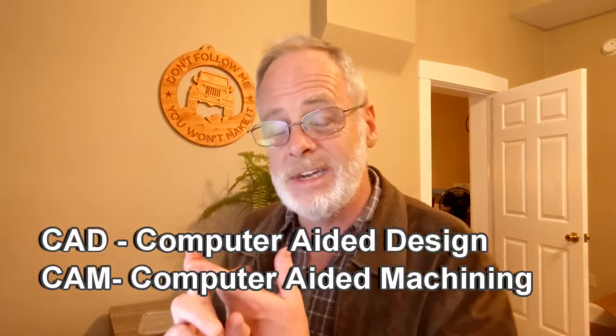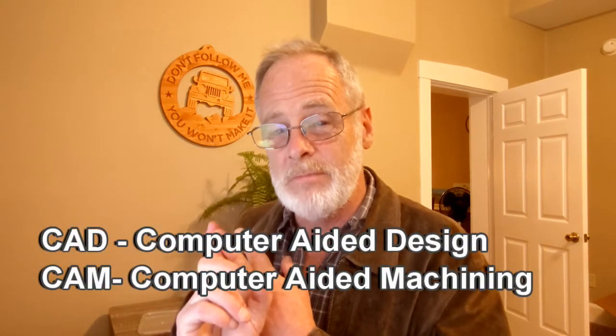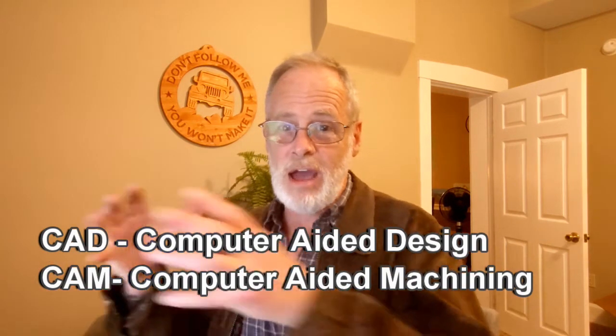So what I'm going to do is I'm going to go into VCarve, my CAD/CAM program. For you as a beginner, CAD is computer-aided design, CAM is computer-aided machining. So we're talking about CNC routers and the software that generates the drawings and the G-code. The CAD part is the drawing part. The CAM part is the part that's generating the code to actually run your machine. So you have CAD/CAM software. Your software has the capability of what my software does. So even if you don't have the exact same buttons, the concepts are all still going to be there.